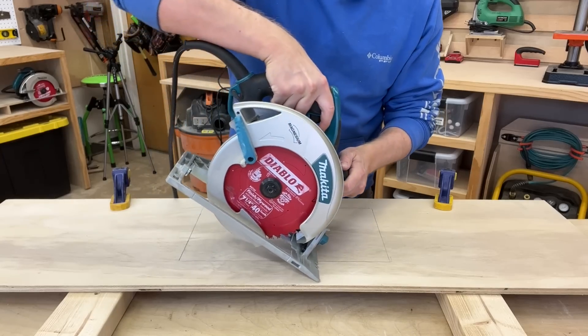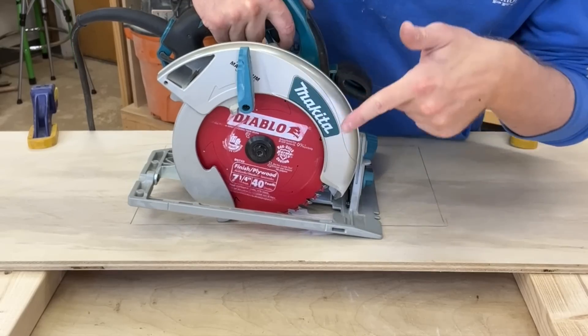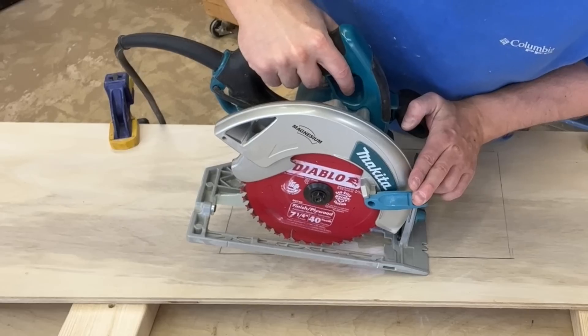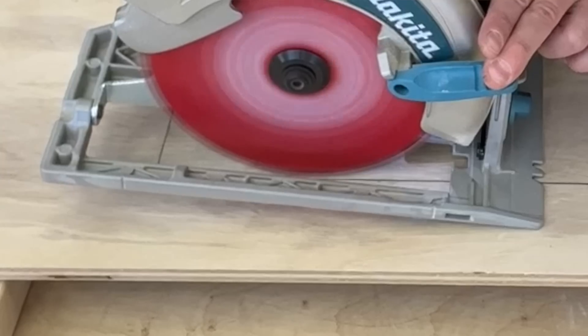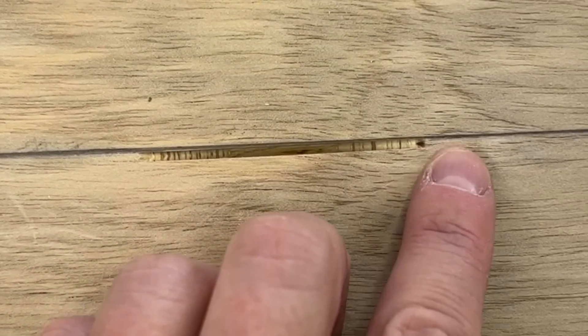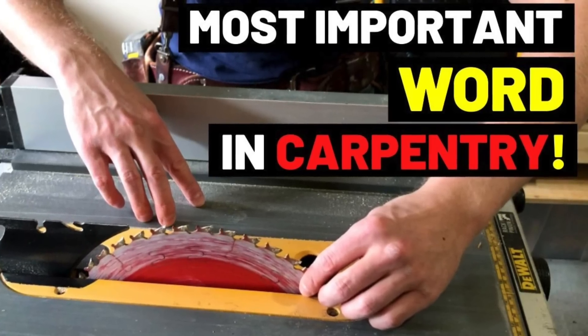To make the cut, you want to use the front of the sole plate as a stable pivot point. Try to line up your blade with your cut mark by sighting from above. You can use the zero increment notch as a pretty quick lineup, then try to get more accurate by sighting down the wall of the blade. You can gently tap the blade to the surface as well. Keep in mind that the blade tooth is slightly wider than the blade, and it's going to leave about an eighth-inch notch or kerf. You want your kerf on the appropriate side of the cut line. I do much of my lineup as the saw is cutting, and I do it slowly.